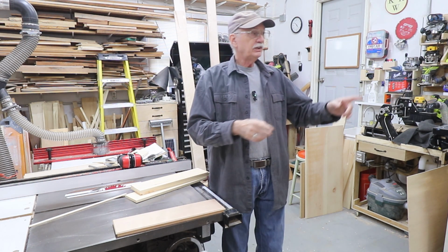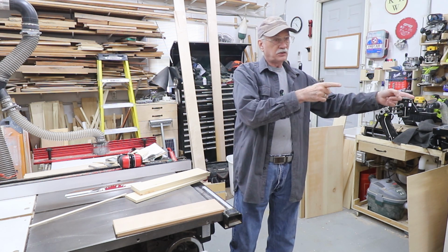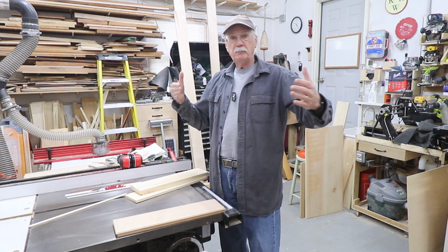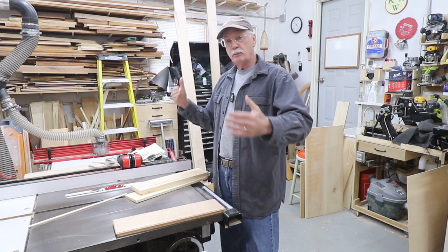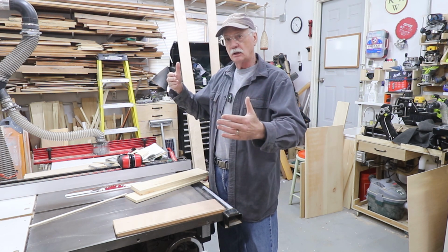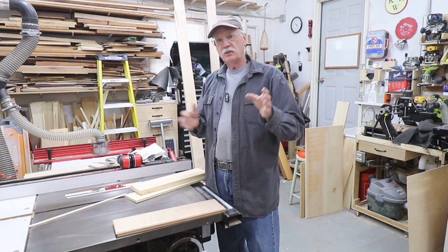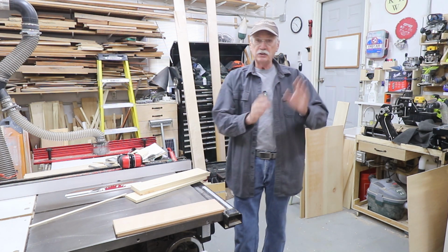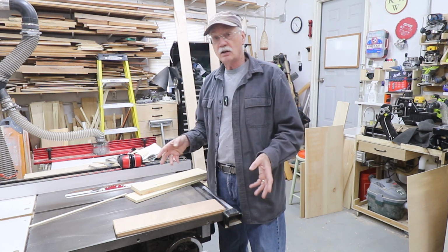I mentioned in an earlier video this is supposed to be 40 inches wide. And it's about 3/4 inch shorter now because the big pieces that I put in there for the top and the bottom, I wasn't aware of it, but when I put the base in and started working, it slipped down a little, even though I had it real tight. And I wound up with dovetails being asymmetric, so I had to cut those side ends off of both pieces and redo those dovetails, so it's a little narrower than I originally had planned, but it doesn't matter.